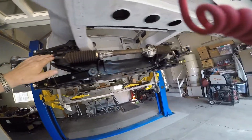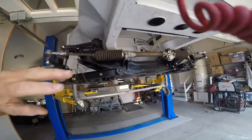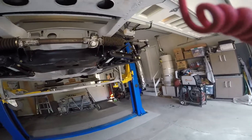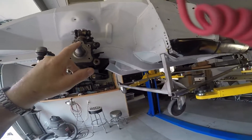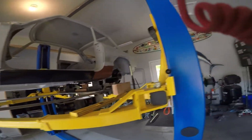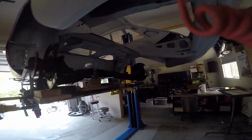What I still have to do: I've got the steering rack cleaned off, but it's not been painted. I've got new boots and everything for it, but I just wanted to get kind of a mock-up going in the front. The main reason is I wanted to check the wheelbase. In checking the wheelbase, I need to center on the front spindle to the center of the rear axle, so I'll show you what I've been doing back here.